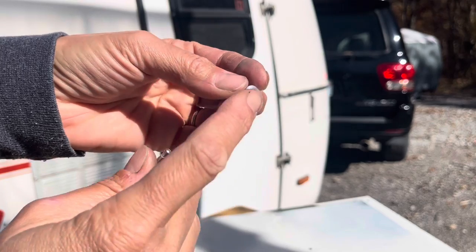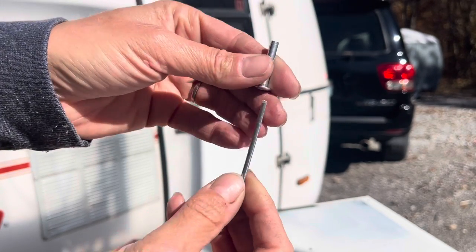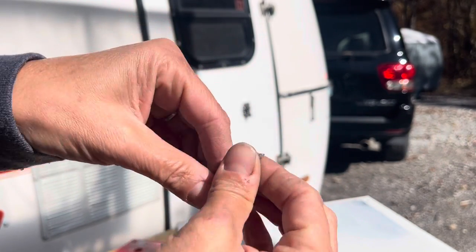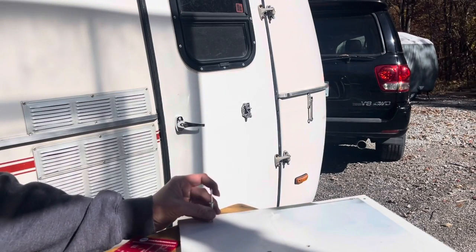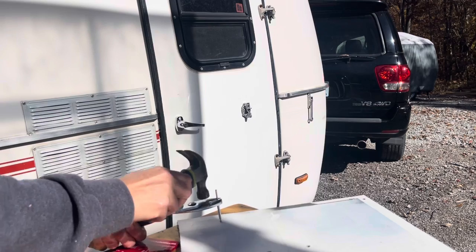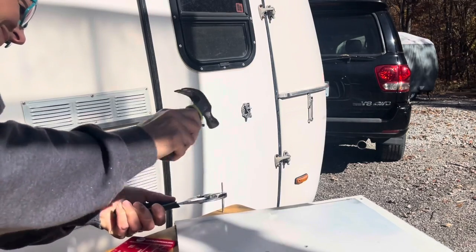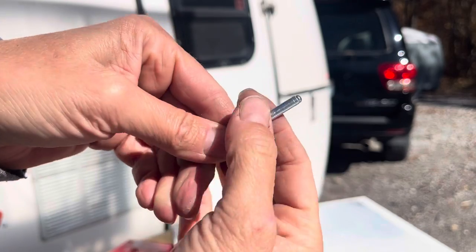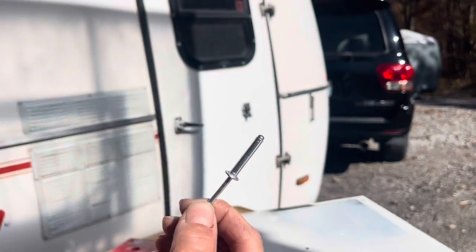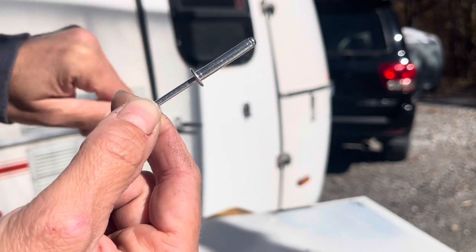Now the pin is loose so you can pull it completely out. Use a hacksaw and cut off the shaft wherever you want — just make sure you don't flatten your hole. If you do, take a nail and hammer it in to open the hole back up. Then put your pin back in, tap it down to the right spot, and you have your cut-down rivet. I've done this before when I just needed one or two rivets a hair shorter than what I had — it worked perfectly.